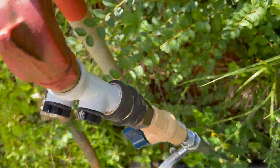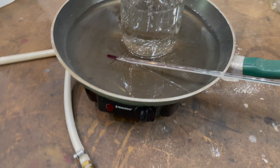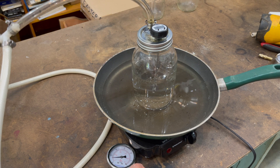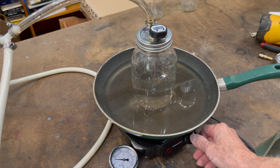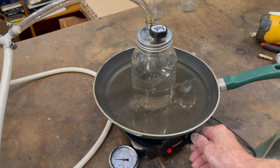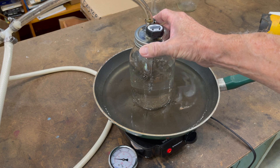I've got my vacuum aspirator hooked up. We're going to turn on the water. This is 3/8 inch ID polyethylene tubing. The rest of the apparatus is the same — it's got the same trap. One difference is I've set this Mason jar on a hot plate, because we're going to have to heat it to get it to boil rapidly. It's got a little bit of bubble formation. We're only reading 27 inches of mercury this morning, and 19.4 on the temperature on the dial thermometer.